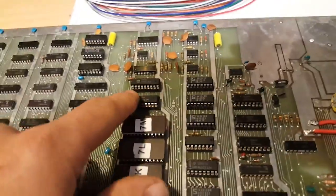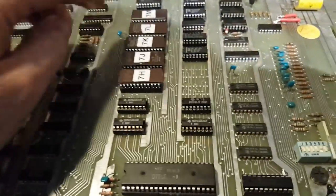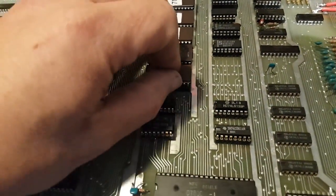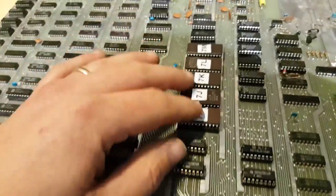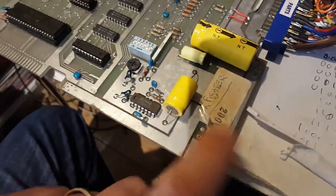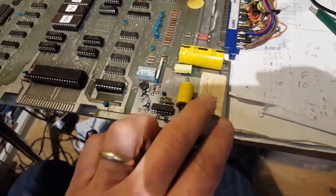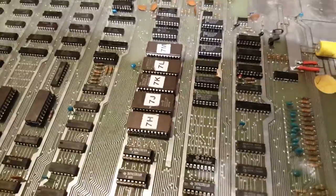What I also did is I changed the RAMs. These are the old RAMs over there. I got some new ones here and here, and these are the video RAMs. These are the CPU RAMs. And I also wanted to double check that this was the right ROMs for it. As it turned out, what I had put in it was a Galaxian B or something like that, the bootleg. But it's not actually Galaxian bootleg, technically. So that Starfighter, which I think is a Moon Cresta bootleg, but initially it would have been Kamikaze 3, which is a hack of Galaxian, essentially.